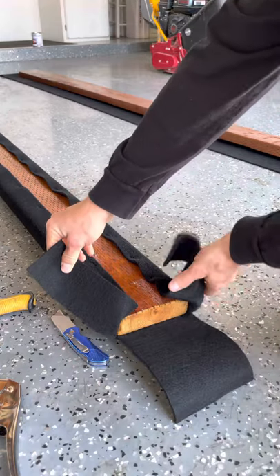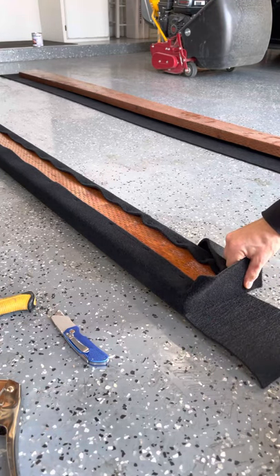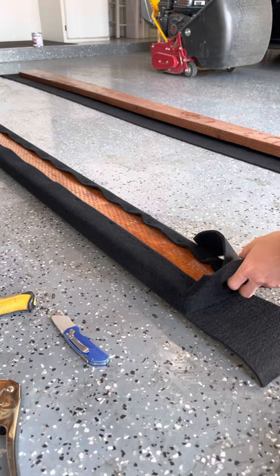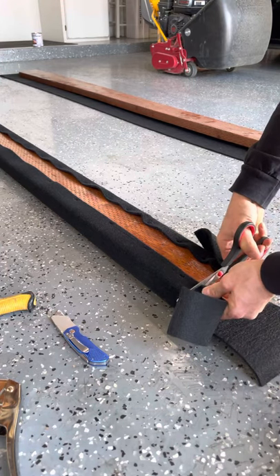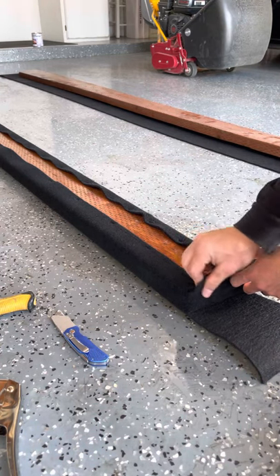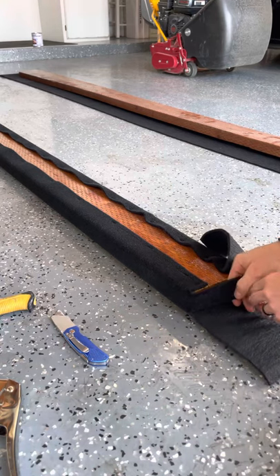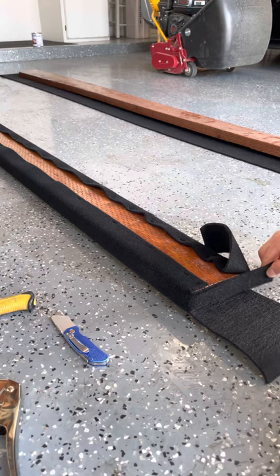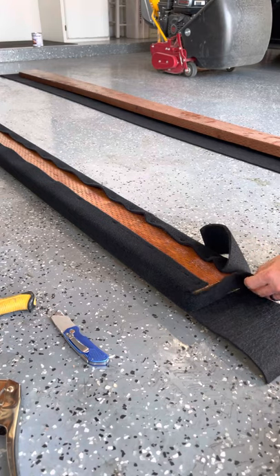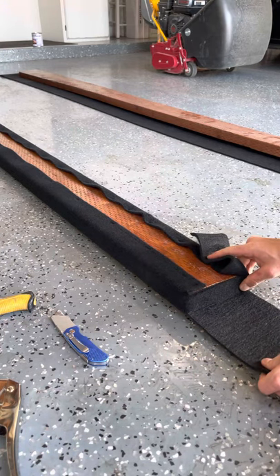So here's what it looks like. We're going to fold this side onto the back of the board, and you'll notice there's a lot of excess carpet — we're going to cut that off. First I'm going to cut this top portion down an inch or two. Now that folds better. I'm going to cut off the excess up top right there. You notice this piece comes over past the board, so I'm going to cut off about an inch right here. You just don't want it hanging over because we're going to staple it — it won't be as clean. So it looks much better.